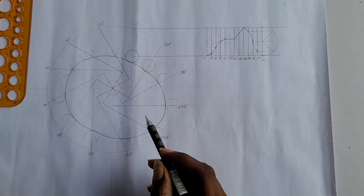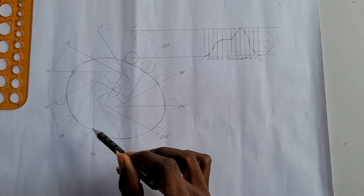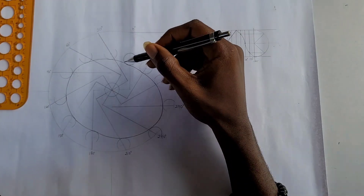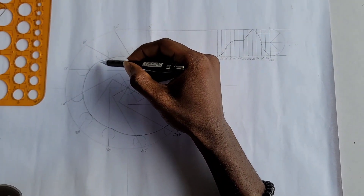I've now drawn the curve connecting all the offset rollers at their tangents. As you can see they are touching the offset rollers at the tangents — it doesn't have to follow the arc line exactly, it just has to touch the offset roller at the tangents.